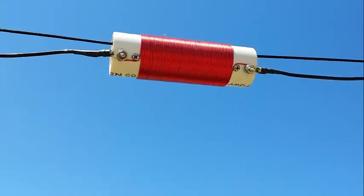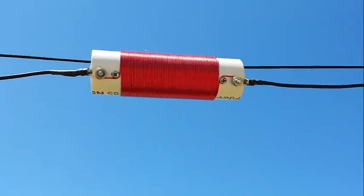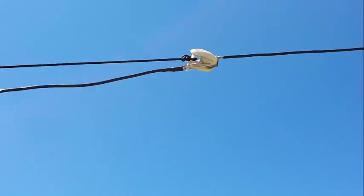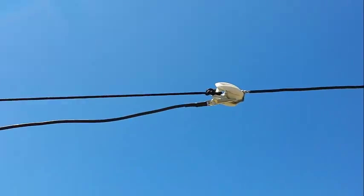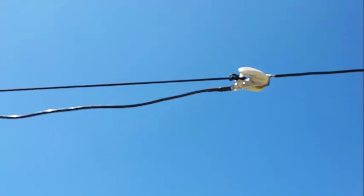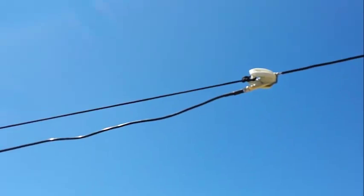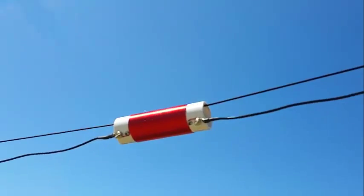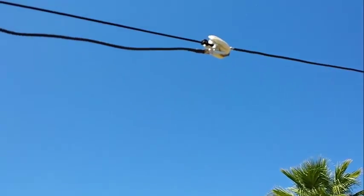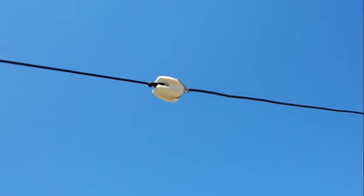When I first put this on an analyzer, attaching the coil right at the end of the 40-meter wire, it went way high in frequency. An additional 2 feet of wire brought it back down, so the 40-meter antenna is now flat across the 40-meter phone band. Simple — if you want 40 only, there's 40.